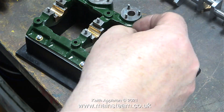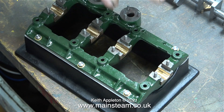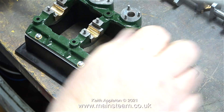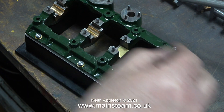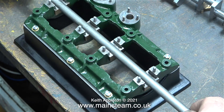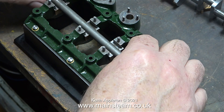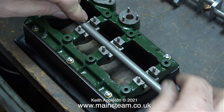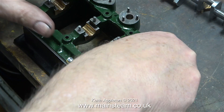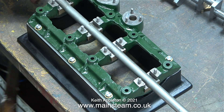By lifting out the lower bearing halves one by one, I soon found out which bearings were not in the right place in the sole plate. Here I'm packing them individually with pieces of brass. Fitting these brass shims is very much trial and error — I've edited out all the parts of the video where I bang my head on the workbench. Eventually I managed to stop the piece of silver steel from rocking about in the bearings; this part of the job requires a lot of patience.